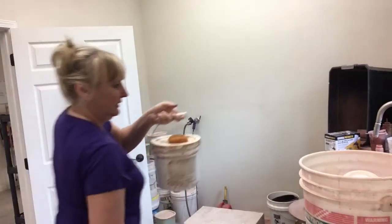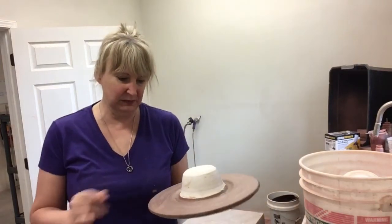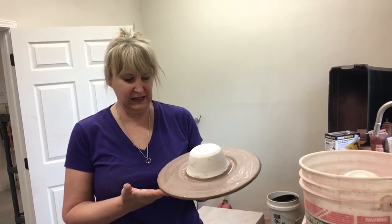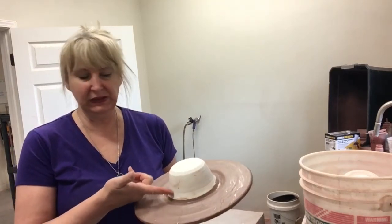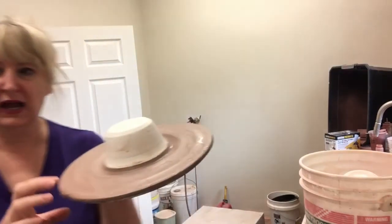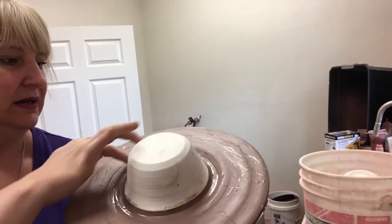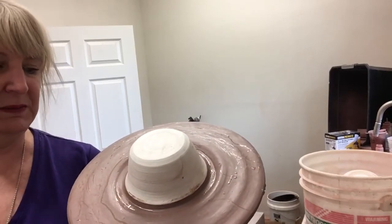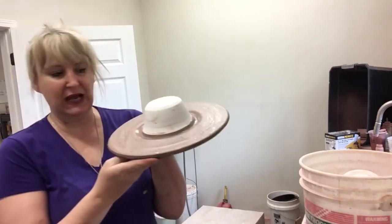Here is the soap I use — I'll put info on how to get it in the comments. I've been casting for about 10 years; by no means am I the best caster, I still consider myself a beginner, but I can teach you the basics. I took this piece — it's upside down, filled completely with clay inside — and created what I call the cutting edge and a gutter, where excess clay goes and creates back pressure. There's a thin spot where the clay breaks off when you press.